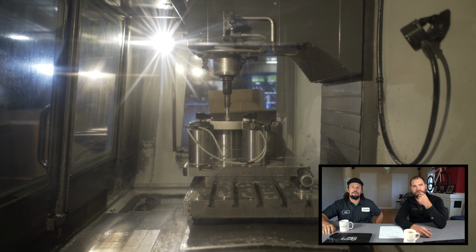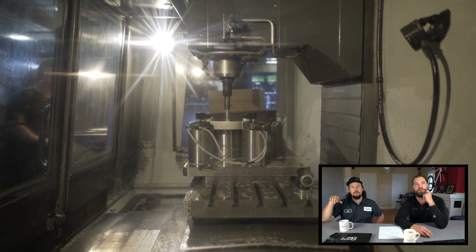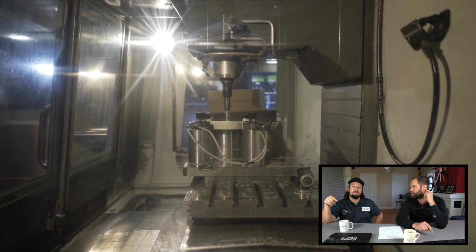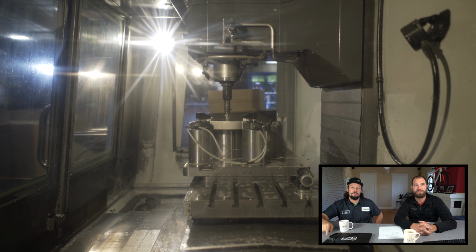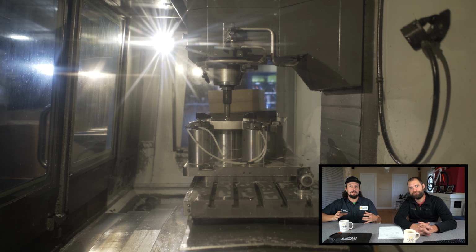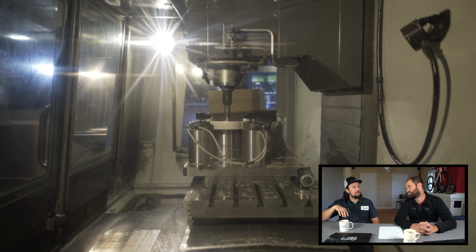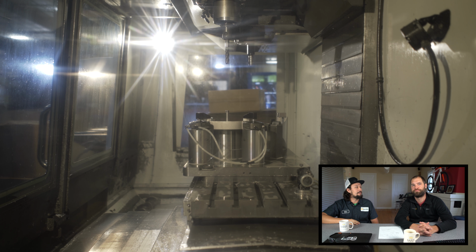And what have we got here? What's this? So right now we're pressing in the axle. Wonderful. So we're pressing into that bore that we machined earlier. That was the last step. We've cleaned it out, and that's important for accuracy and the dropout spacing. And now we're pressing the axle in. Doing it this way allows us to ensure that nothing changes. The casting's in the fixture, it's not going to move. We machine everything to that, and then it allows us to press the axle right down the center of the bore that we had just previously drilled.